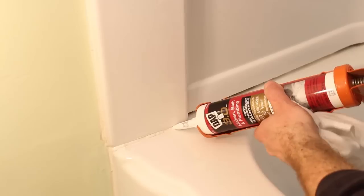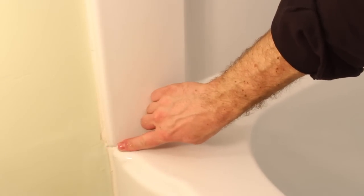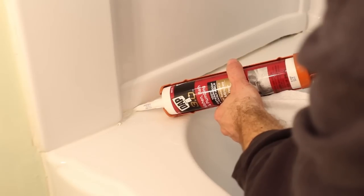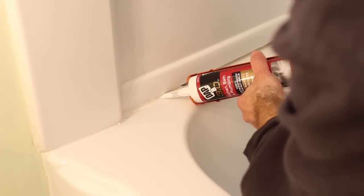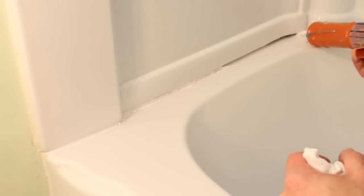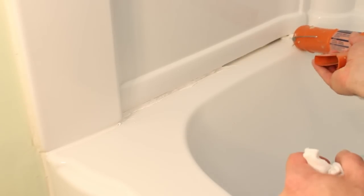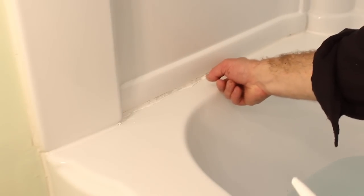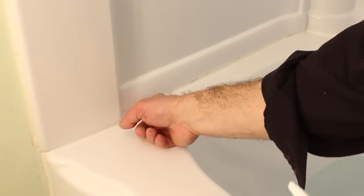Start at the edge of the tub and surround and work your way inward. For awkward-shaped tub and tub surrounds, I like to dip my finger in the water that's in the tub and then smooth out the caulk until you get to a point where it's a longer run. As you can see, I'm slowly pressing down on the caulking gun. Because there's water in the tub, it makes it a little bit awkward. I like to stop in the middle of the tub surround, go to the next corner, and then work my way back inward. Smooth out the caulk by dipping your finger in the water and moving in one direction — left to right or right to left. It can be a little tricky using your caulking gun around a tub full of water, so just be careful.